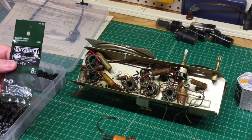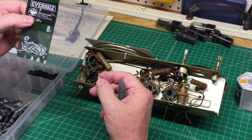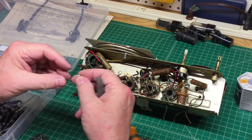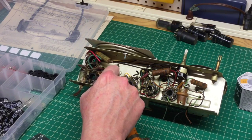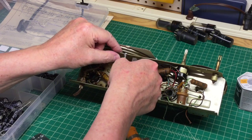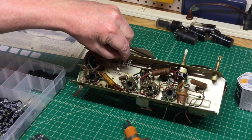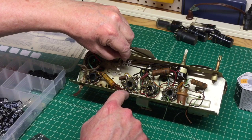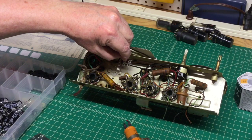Here's what I elected to do: I cut this strap off and removed this little small fastener — it was a number 6 screw — and I put a new number 6 screw back through here. This other end of this wax capacitor will need to be grounded when it's replaced as well. I'll use this terminal strip and mount it here, then mount the new electrolytic capacitors back down to their connection points and route the new wire from the rectifier tube.